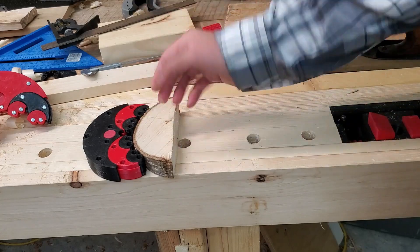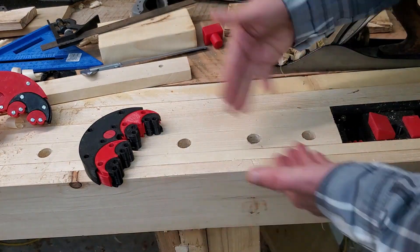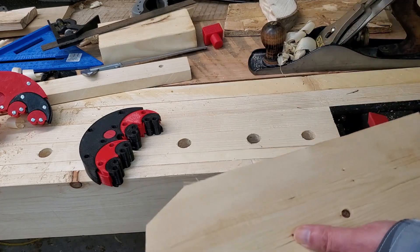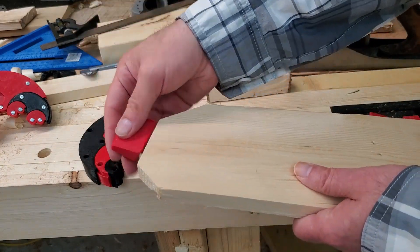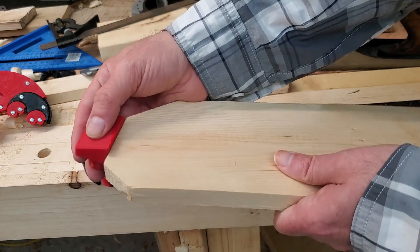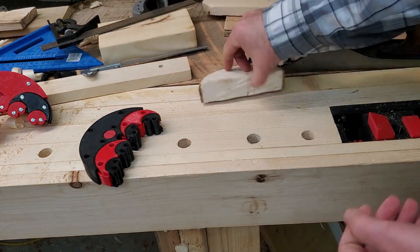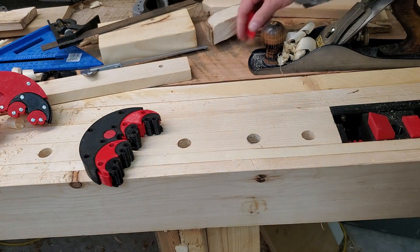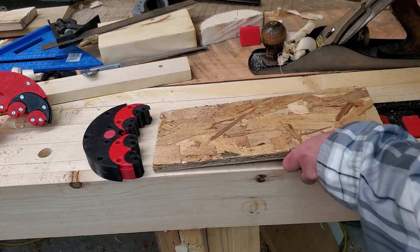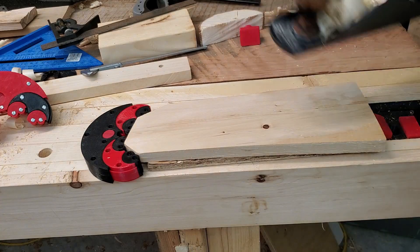So you might ask what it's good for — one thing is it's just sort of fun because it'll conform to curved surfaces or irregular shaped objects. If you take a typical bench dog and try to use it in a wagon vise or on a workmate, if the dog is on an irregular or angled surface it's going to have a tendency to kick out of the clamp if there's any lateral force involved. Curved objects are even worse — it's teetering on that point contact and any lateral force and it'll just fly out of your clamp.